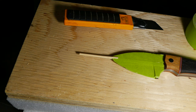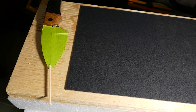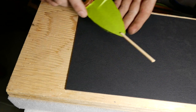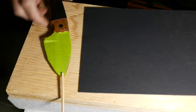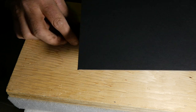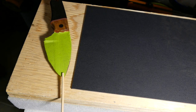Okay, we're done with our knife. Let's cut a piece of Kydex. So there are two types of sheaths you can make. One is called taco style - you cut one piece of Kydex and wrap it around your knife on both sides. The other is pancake style, where you cut two pieces of Kydex, place one on the bottom and cover with the other. I'm debating which one to use, but I think using two pieces is a little bit easier, so I'm gonna try my first sheath pancake style.